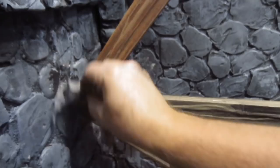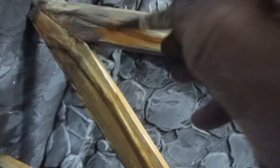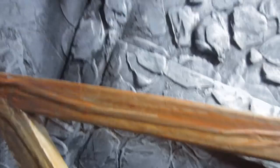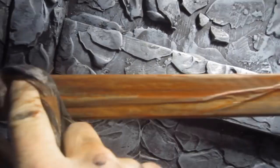The stuff that hits the walls isn't a big deal because I'm going to be touching the walls up quickly too. Then I mix up a little burnt sienna kind of brown, very watery, and just lightly go over it. Then I hit it with the hair dryer a little bit and just take a rag and knock it back a smidge — take off some of it. They match up pretty well.